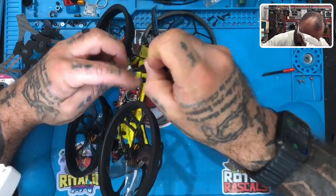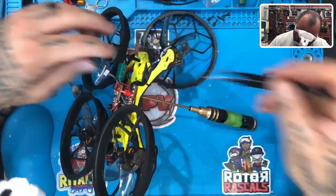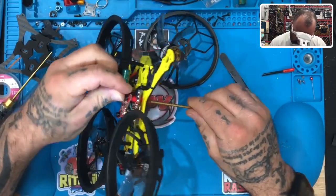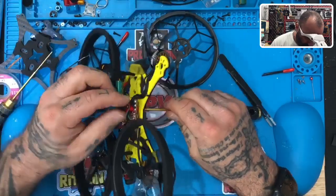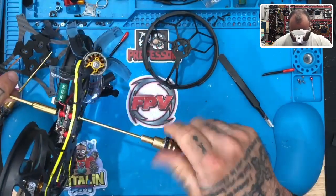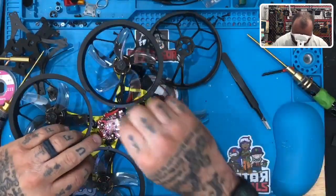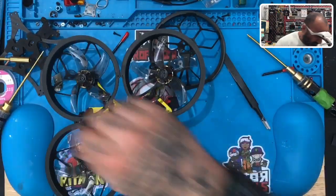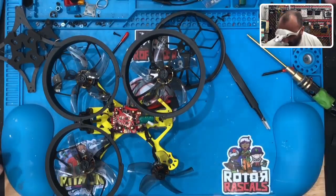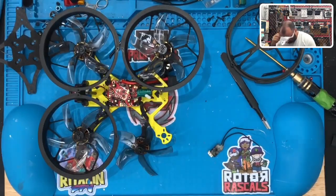The problem is passing that through is getting stuck, so I'm just going to lift the VTX just enough to get this over here, because I want to put the receiver in the back. Is this a 300 milliwatt VTX? Yes - I thought the Zeus went 350 but I'll check. That's plenty - where I fly, 25 milliwatts should be fine. I've flown HGL micros with 350 and I've never had to go above 25.